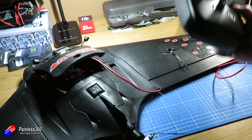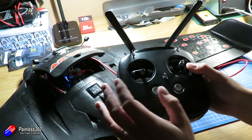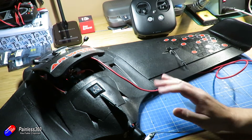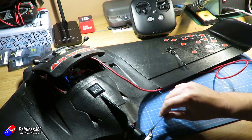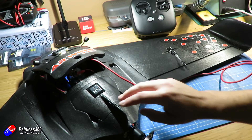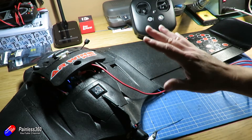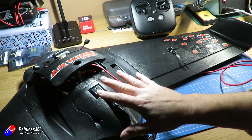For the testing I'm using the DJI FPV controller — don't worry about that, any radio will work. It's the same for mode one and mode two. We just need to check that the radio is set up properly, because in INAV you can occasionally manage to set it up to chase your tail. Quick tip: I do have my prop installed here — don't do this on the bench. Remove your prop if you're ever going to connect main power. I'm going to have to do it unfortunately because with the DJI system it won't connect without main power, but there's something we can do before powering things up.